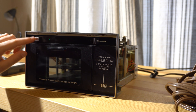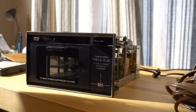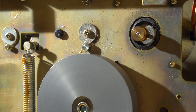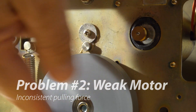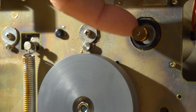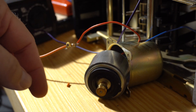We replaced the rubber band with a real belt, but we still had lubrication issues. At the flywheel turn, the motor just had no pull and kept stopping — every so often the motor would work. That motor is almost 46 years old and under a lot of stress, so something's probably burned out. First I wanted to make sure it was the motor and not the circuit, so I took the motor out and wired it up to an independent power supply, and sure enough, we got the same problem.